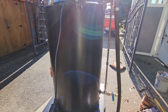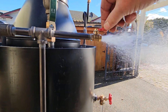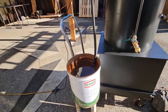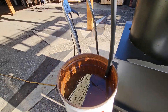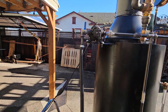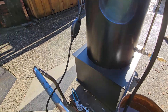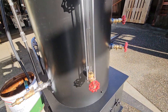It'll melt right away. I'll turn it on. This is your airlock valve. If there's any air in the line, get that out first and then everything pumps right into the boiler. You can see it's slowly going down — it pumps very well. You don't want to add too much water at a time, though. You'd kill the steam if you do too much. It's got a little switch right here — just keep that away from the firebox.